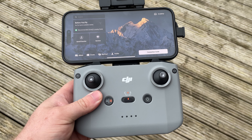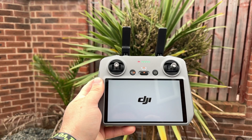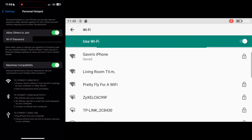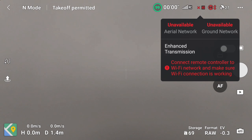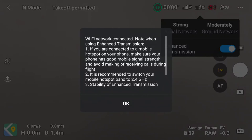The DJI Cellular Dongle 2 with a data SIM provides 4G connection to the dongle sitting in your drone, but you also need a 4G connection on your controller. If you are using a mobile phone with the DJI RCN2 controller, you likely already have a network connection. If you're using the DJI RC, you can tether it via mobile hotspot to your phone on location. A third option is to pair the DJI RC to a home Wi-Fi router and utilise that network connection, which works absolutely perfectly.